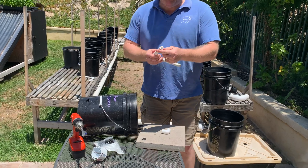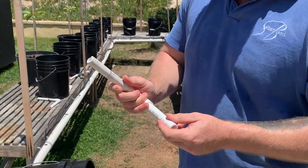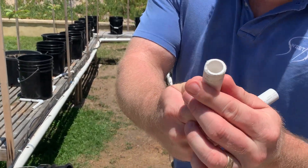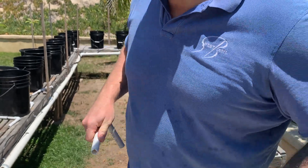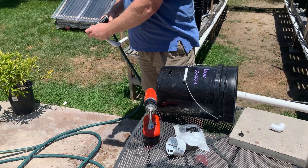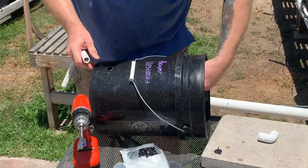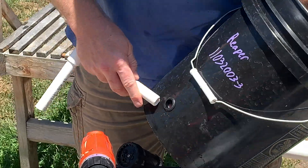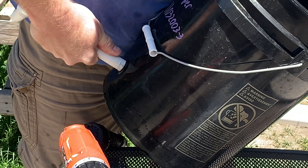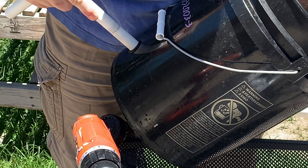Once I cut it, you can see it's got a pretty sharp edge. So what I'll do is take the sharp edge and just kind of sand it on a piece of concrete or a brick until you see a little bit of a bevel on the edge of that pipe. That's going to help us feed it into this hole with the grommet. I'm going to get this a little bit wet so it slides easier — just a dab of dish soap might help to get it in there. Get one hand in the back to hold the grommet in place, and then you're very easily going to just work this sucker into that hole. You can see it's a nice, tight fit.